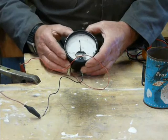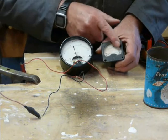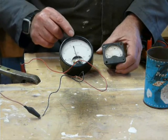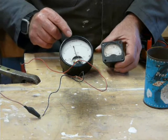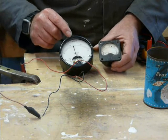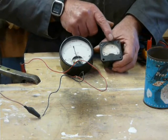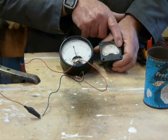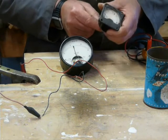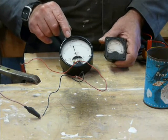Anyway, that's just a little bit of motorcycle history. The main point is: you can change a voltmeter from a smaller range to a larger range by including a Zener diode. You buy these at set voltages — 10, 20, 30 volts and so on. For instance, if you bought a load of 10 volt Zeners and wanted this 20 volt meter to read up to 60 volts, you'd just put four Zener diodes in series in line with the meter. Same with this one — it has a 30 volt Zener; you could use a 20 and a 10, or three 10s.